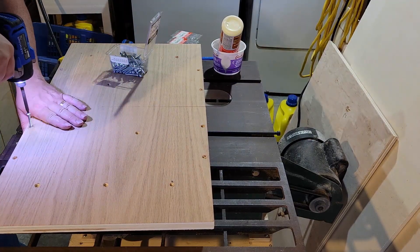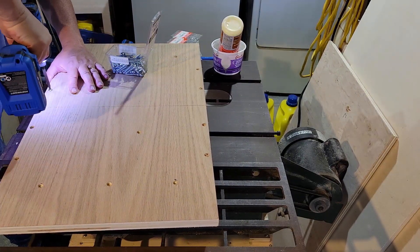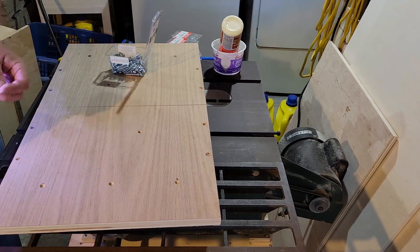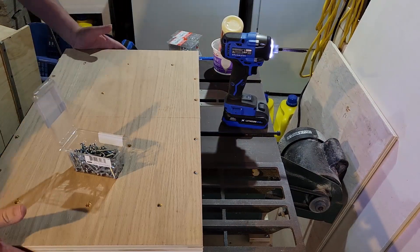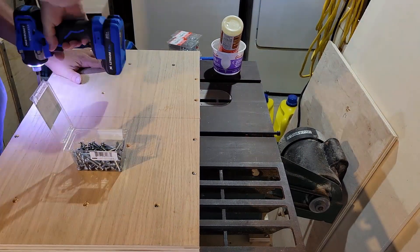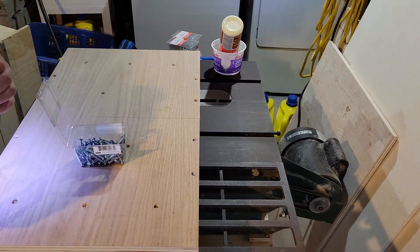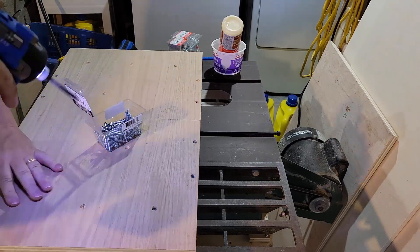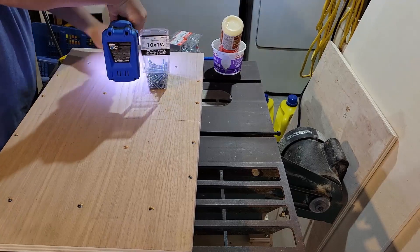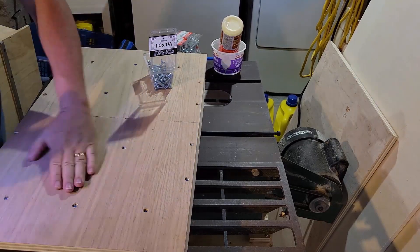Now it's a simple matter of making sure everything is relatively positioned. It's not critical — there's a lot of give — but I'm going to try to center it reasonably well using that center piece of plywood as a reference to eyeball it straight. I'll put one screw in on one side, tighten it a little, then put the other screw in and finish up all the holes. The hard part coming next is building a framework to attach this to the saw, getting the extension as flush as possible with the top of the saw — not underneath, not sticking up too much.